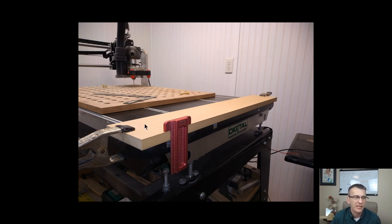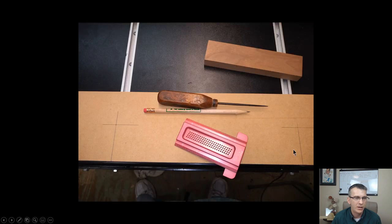I brought one of those pieces over to my table, clamped it into position, and used a little T marking square. I found the center of each of the T-tracks and made a mark. That allowed me to lay out my layout lines. Crossing that mark at the center of this 4 3/4 inch piece, 2 3/8, I made another cross mark, and that would be my X marks the spot center for drilling that hole